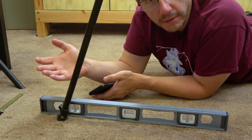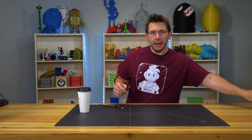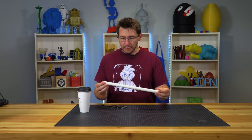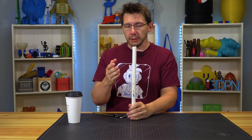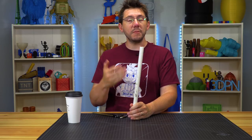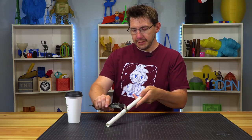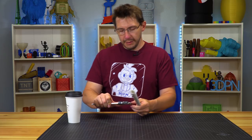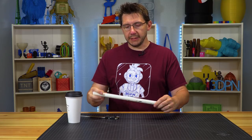So we've got essentially 20mm on the diameter and 24 degrees for the angle — that should give us enough information. For the extensions, I have this idea: I have lengths of PVC pipe. If the leg comes down and attaches to the PVC pipe, the tripod will get taller, and because these are vertical it won't take up more space. With the calipers, the PVC pipe measures at 21.5mm in diameter. Coupled with the tripod leg measurements, we have enough information to build something in Fusion 360.